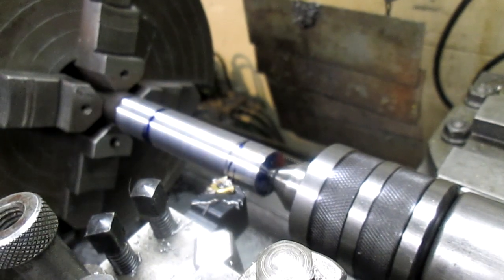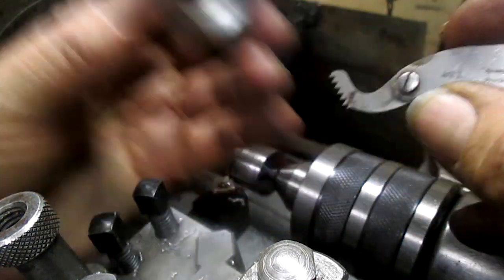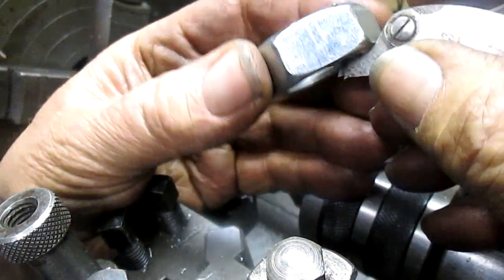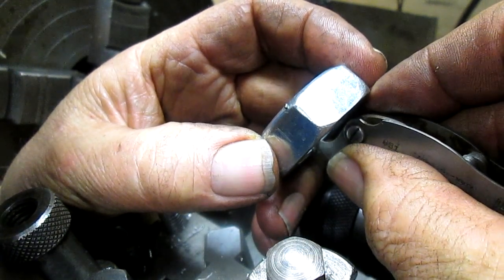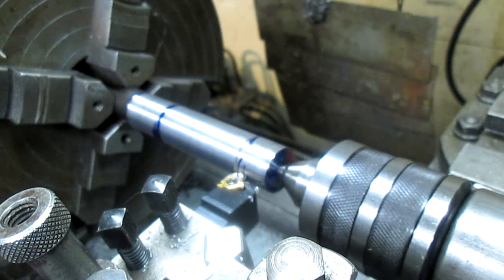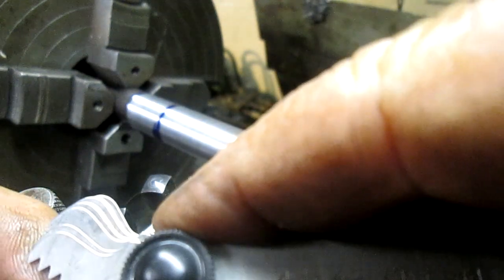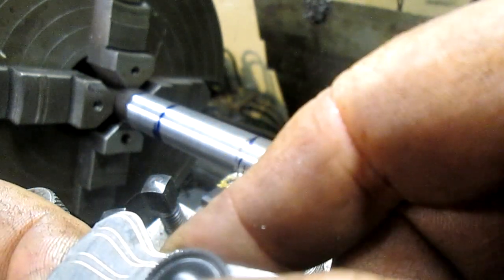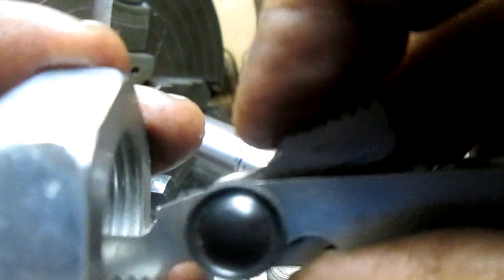Let's make sure that we've got 12 threads per inch. Let's take our nut and make sure we got 12 threads per inch on the nut — and I'm not sure that we do. No, we don't. Hell, this couldn't be a metric nut. Alright, let's just figure out what we got. There's our number 15 — 13. Let's try 12 — 11 and a half — 12. It's definitely not 12 threads per inch.